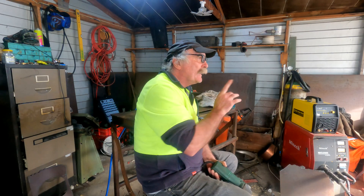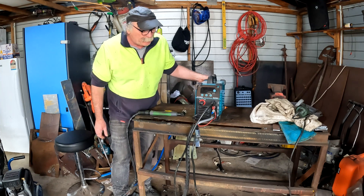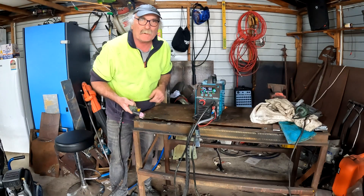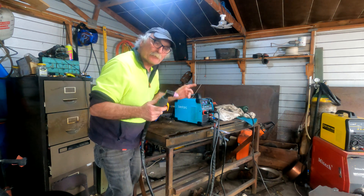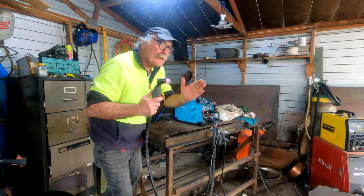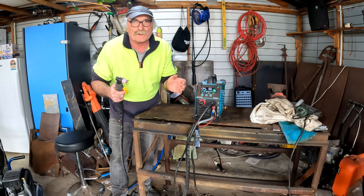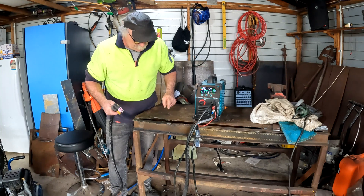Anyway guys, same as usual - if you like my video, subscribe, drop me a like, drop me a comment, come say g'day in the comments below. Let's get into it. So my friends, if we kick the old plasma cutter on the guts, let's see what happens when we try and amputate a finger. I'm using the Bestark 7th generation machine. It's probably one of my favourite machines at the moment. This machine is a Pilot Arc. If you haven't been watching my channel and don't know what Pilot Arc is - Pilot Arc is when you pull the trigger, you get a flame coming out before you actually have to touch your steel. In other words, it's like an oxyacetylene torch. You pull the trigger, flame comes out, machine starts up, and you start cutting.